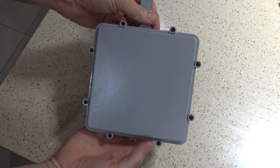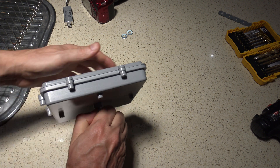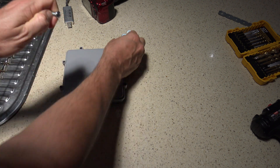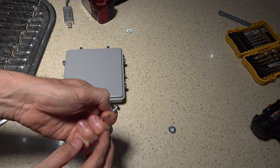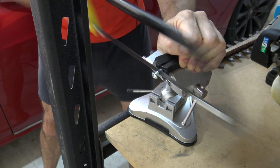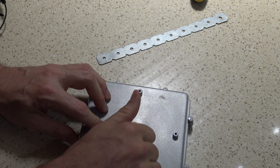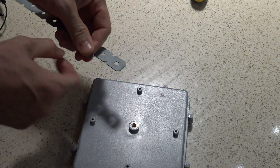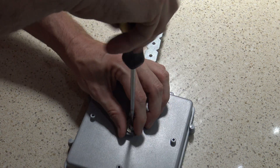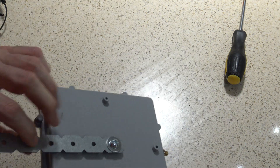So that's what I'll do — drill the bottom hole out on this bit of metal so the bolt can go through it, hacksaw the bolt right down so it's just as long as it needs to be, and use some washers to pack it up. I'll do this over the bin to try and catch the filings. Just hacking this up in the garage with the old toothless hacksaw. That's now shortened and fits in — cool.